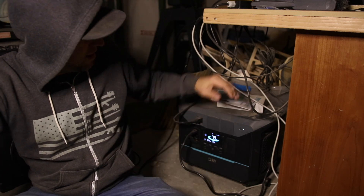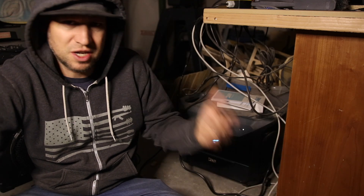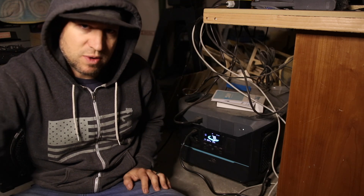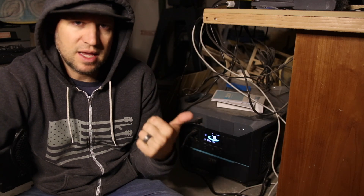I've got a flashlight on me right now and the whole garage has gone dark. But this battery backup is still running. I forgot that I left my space heater — I'm pretty much powering my entire workshop, all my tools and stuff off of this thing, really running it through the ringer. So I had a space heater plugged in and it's currently running. You can see it's drawing about 825 watts. There are three settings on that space heater — low, medium, and high — it's on the medium setting which is about 800 watts. I have about 78% battery left, and it's been running the space heater for almost an hour. My guess is that if I leave it on that setting, it would probably run it for close to four hours, which is pretty impressive.